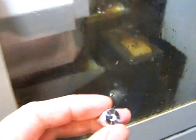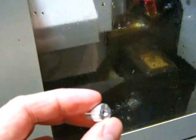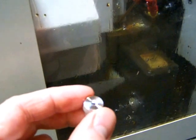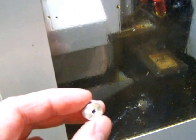Okay, here it comes. And the sub-spindle comes over, and I'm taking my good sweet time making the cutoff because I want a really, really clean cutoff on the back side. I hope you can see this on camera, but it's just a beautiful cutoff. I could do that with a counter boring tool on the back working tools. It's a separate operation, but I like to just spend a little bit more time, use that cutoff tool because you have to have it anyway, and it's just one less tool to set and get adjusted.